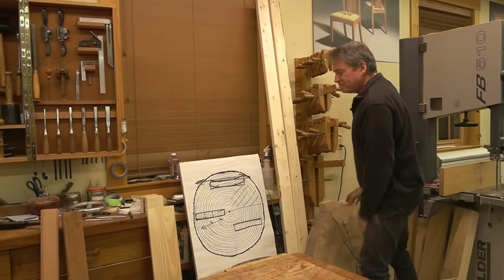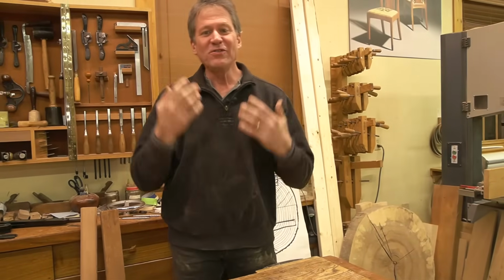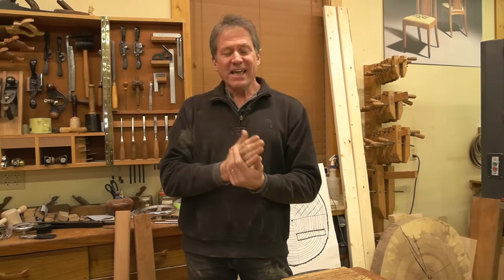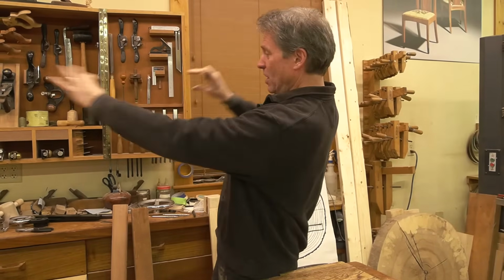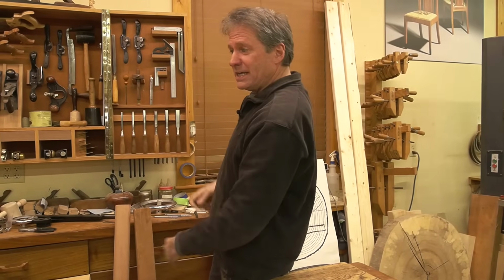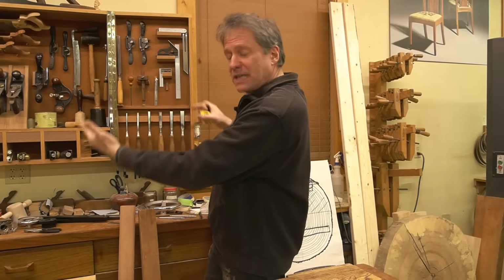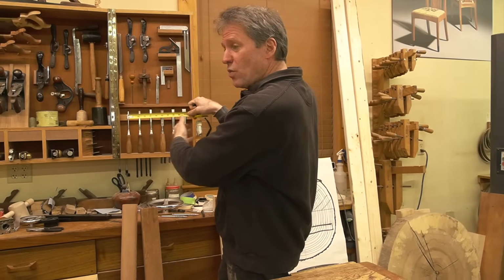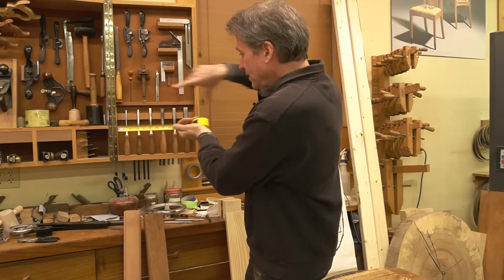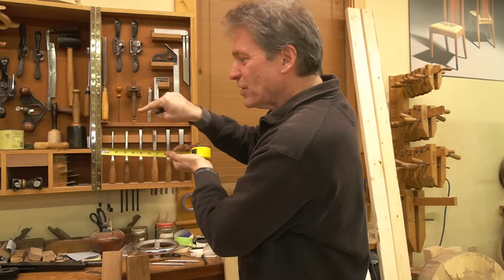When buying wood, I'm looking at the quality of the wood indicated by the closeness of the growth rings. So when I come up to a bin of all these boards in the lumberyard, first thing I'm thinking is, okay, I know I'm in the right bin for the thickness and type of wood I want. And then I'll think, okay, I know I want them to be so wide. So I'm looking at those widths on end. And then I'm looking at the quality of the growth rings.